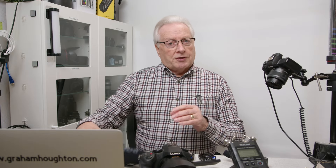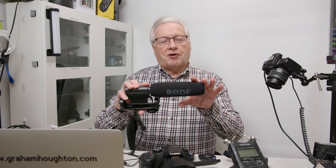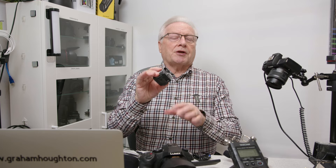There could be a situation where you have a stereo microphone, something like this. This is the Rode Video Micro — but this is a mono microphone, though you can get them as a stereo package. So if you wanted to take the output from this device to the camera wirelessly, you're going to have to connect somehow from the stereo source to give you an independent left and right channel, so you can transmit it wirelessly and receive it as a wireless left and right channel, and then output into your camera.